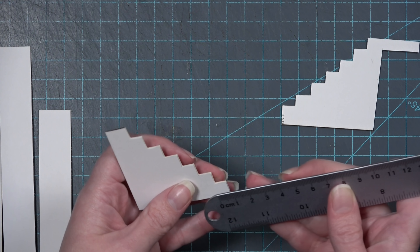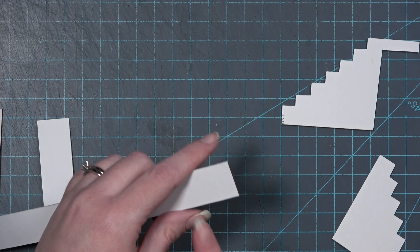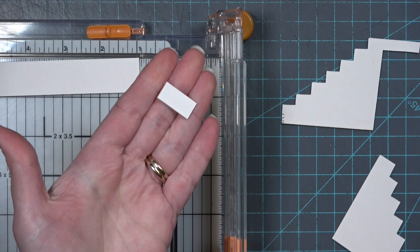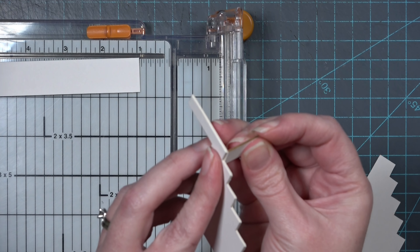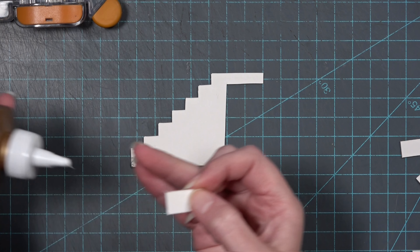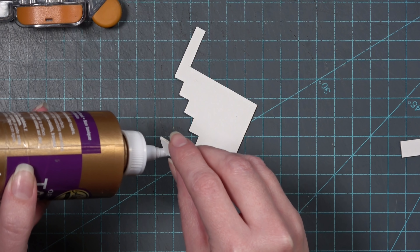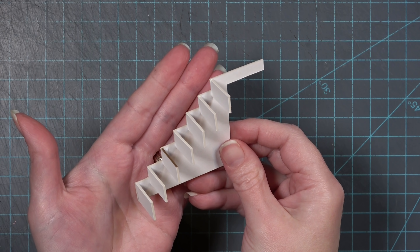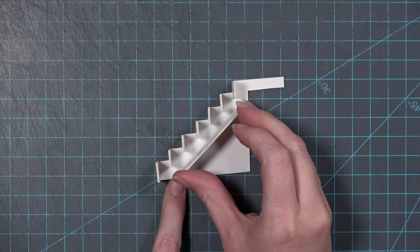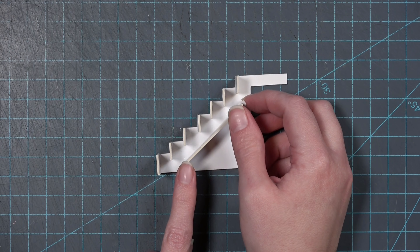You can really make your steps as wide as you want — I'll just call it the stair interior thickness so you can create it however thick you want. Our rise measurement was 8 millimeters; I'm double-checking that everything is still 8 millimeters between each step. To create the rise front panels I'm going to be cutting from that stair interior thickness piece — for me that was 7/8 inch. I'm cutting it a little bit longer than 8 millimeters, because it's easier; it will drop below the rise line but that's okay. You'll also have to custom cut a piece for the front step to perfectly enclose that area. I carefully lined up each rise with the top of the step without worrying about it going too far below, because you won't be able to see that once everything's done.